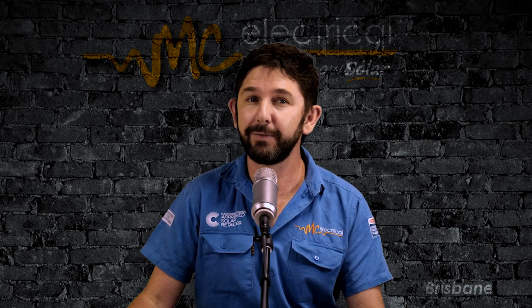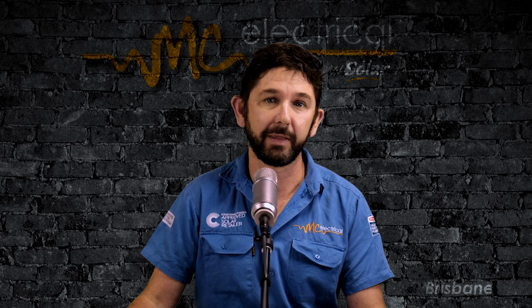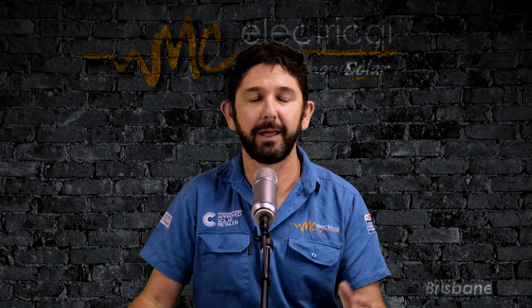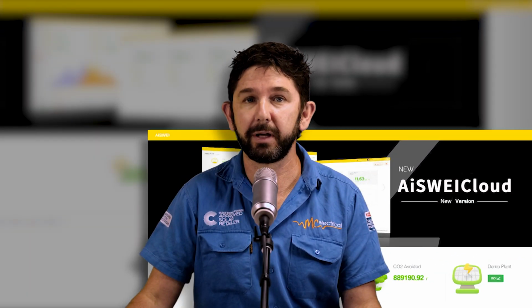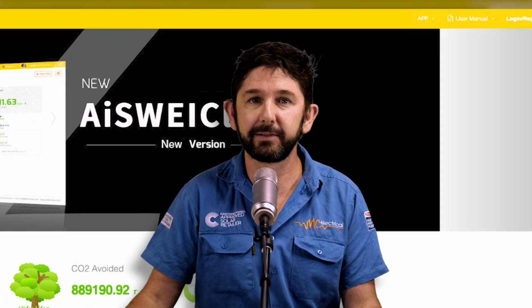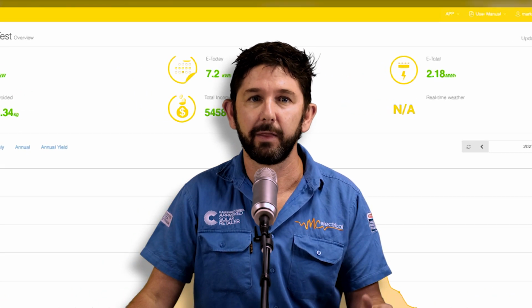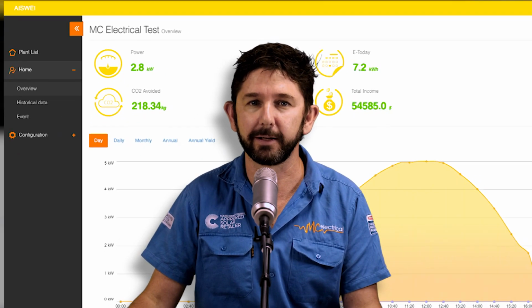The fact that you don't even have that option currently with SolPlanet is disappointing. Now, SolPlanet tell me that option is coming soon, but I haven't had a chance to review it. If it does have a quality and affordable consumption monitoring option, the inverter will be okay. If it doesn't, I think the inverter is just a waste of space. Now, apart from consumption monitoring, the monitoring platform is okay. It's simple enough for the end user, and it's got enough data for electricians to remotely diagnose any problems that might arise. The data is recorded in 10-minute resolution, which is pretty average, but it's not a deal breaker.